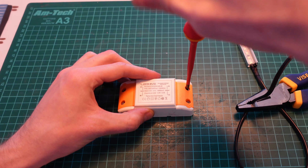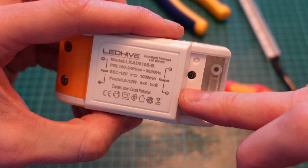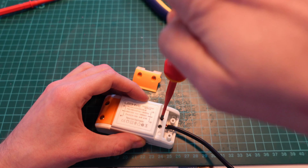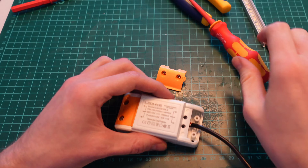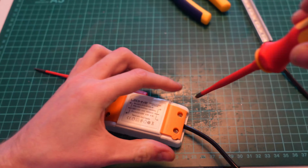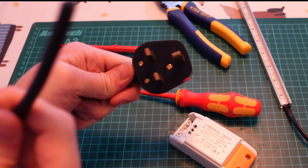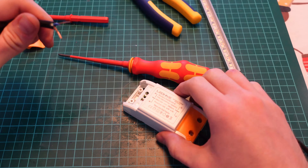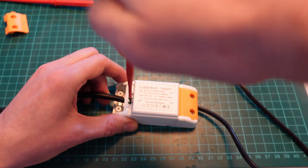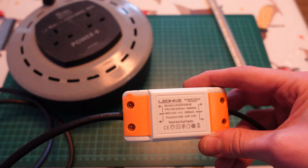Let's also look at how you would connect up a mains power transformer. I've started by opening up the output side, which will go to our baton. It should indicate the positive and ground output — make sure to insert the red to positive and black to ground. Tighten it up, then reinstall the cover to clamp it all down. This is similar to how the cable tie on the baton will help support that joint. Then rinse and repeat for the input side. Here I'm using a pre-cut and twisted UK mains power cable — the brown is live and the blue is neutral. Check for the indicated live and neutral input, slot it in and clamp it down. It's not necessary to tin these wires if you don't want to. Give it a little tug test and then plug it in to test it's all working.